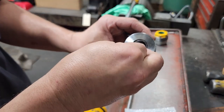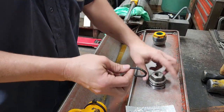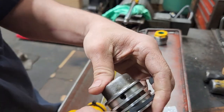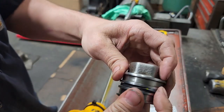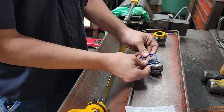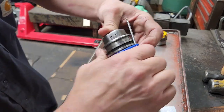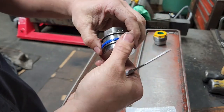Onto the piston — start with the o-ring, goes on the inside right there, just push it in. Then the expander: this has some yellow marks on the outside to let you know it's in the right way, basically to let you know it's not twisted. Just walk the expander around. Then the piston seal — get it started, walk it around, and for this I'll use a straight pick to get it under there and holding tension just walk that around. And that's that.